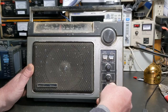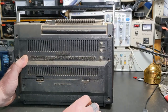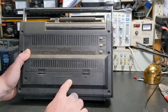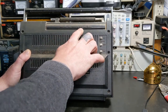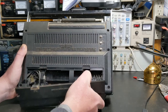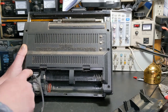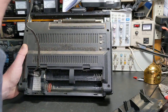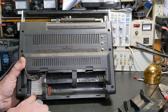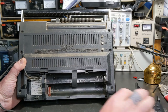It's got the on/off switch up here on top. The telescoping antenna still works — that's all complete. It's even got a 200 millimeter AM ferrite rod inside. It's got connections on the back for hookup to an outside antenna, and it can run off batteries also. Boy, look at the dust in there. We've got the power cord right here. I can see a date code on this — I'm not sure how to read it — maybe somebody knows. The date code reads 3138.